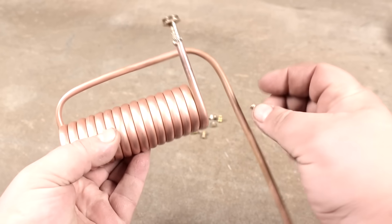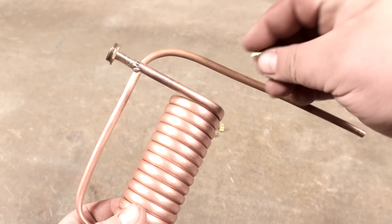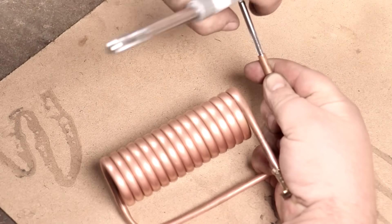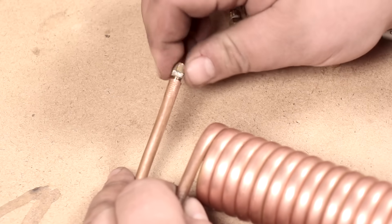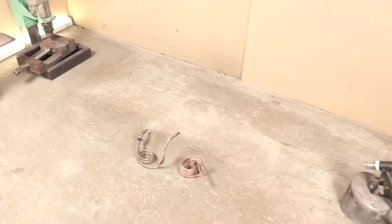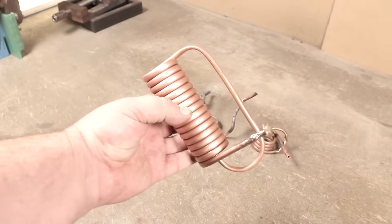The nozzle will be at the end of the tube around here. I will cut off the tube and bend it so that the nozzle is in the center of the diameter of the coils. To be able to replace the nozzle, it will be twisted along the M6 thread. The thread in copper is cut easily. I bent the tube very carefully so as not to break it, training on small pieces. Everything turned out very well, as I wanted, with a small margin.